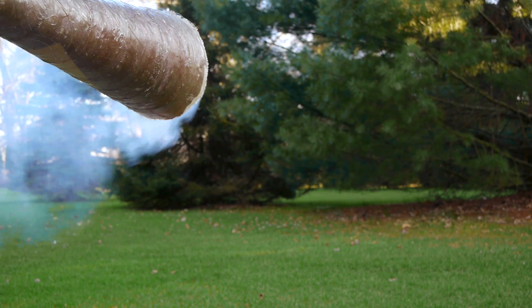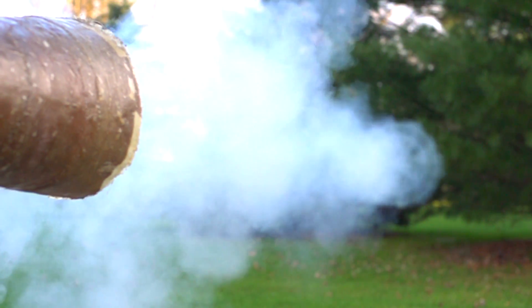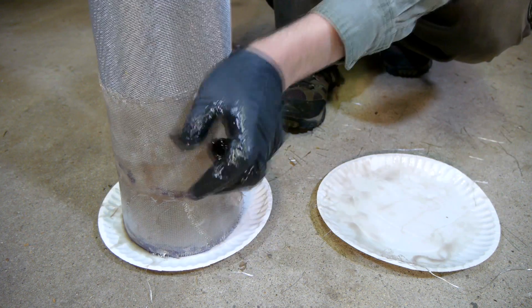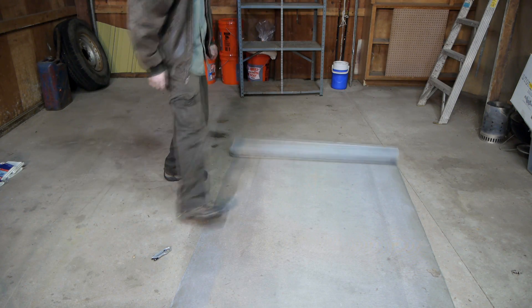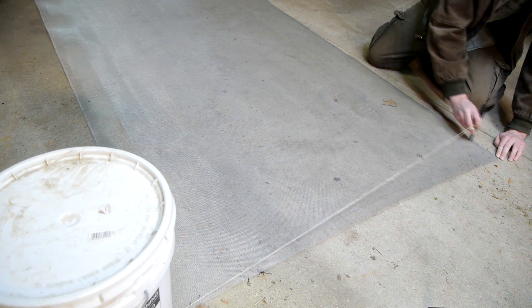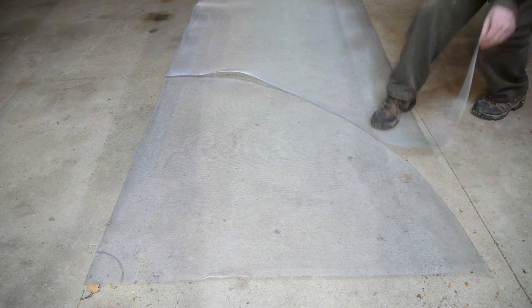To create a shape with fiberglass, you first need some sort of mold or former that the fiberglass can be spread over — like paper mache — and that will support the weight while the resin cures. My first thought was to try window screen to roll a cone as a former. My reasoning was it would be relatively sturdy if rolled in several layers and would have plenty of texture for the fiberglass to stick to.